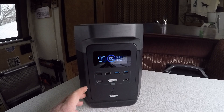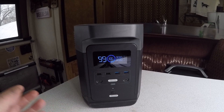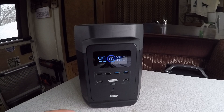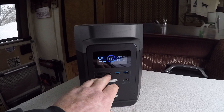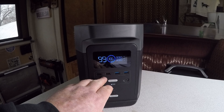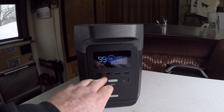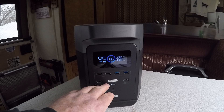The whole pack is 24 volts, made up of cells in a parallel-series combination. That 24 volts DC runs into a DC-to-DC converter which steps it down to 12 volts with current limiting. For USB ports, it drops further to 5 volts. The USB-A ports deliver 2.4 amps at 5 volts, and the USB-C ports deliver the full 3 amps at 5 volts.